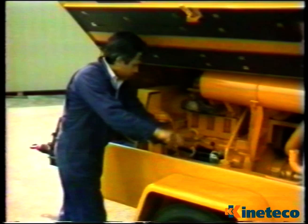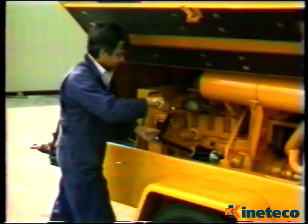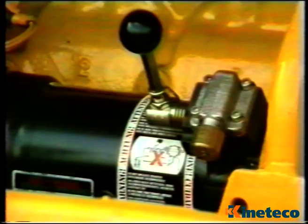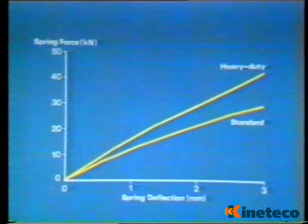When wound, the spring's energy is restrained between the ratchets of the winding mechanism and the trip device. When the trip pawl is lifted, either by a lever or via a cable and remote control, the pinion and shaft are free to rotate. The springs then force the ball nut along the stationary sleeve, rotating the shaft and pinion, and therefore the engine. A fully charged starter provides full cranking power for 80 milliseconds, which is usually equivalent to a third of a flywheel rev — enough to accelerate a typical engine to 450 revs per minute. The inertia created in the engine is usually enough to ensure that it continues to turn for two more complete revolutions, by which time the combustion process takes over.